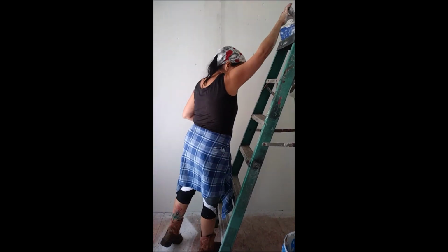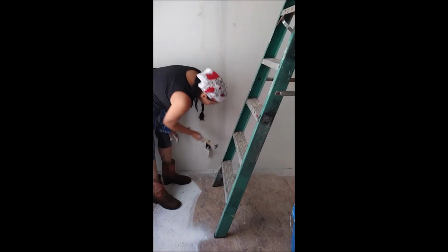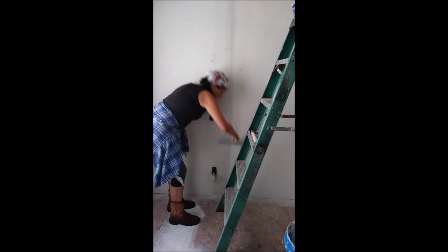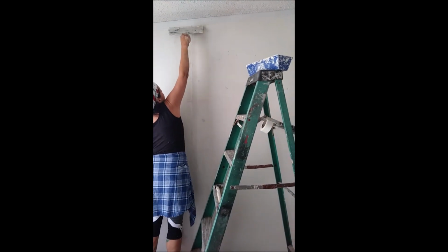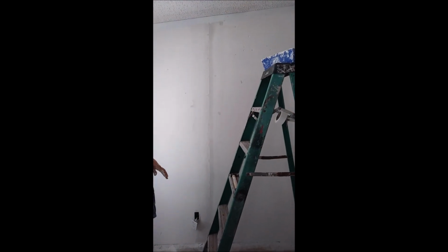And keep your hammer with you, because sometimes when you start bedding, you'll notice in that seam I had knocked down quite a bit. Sometimes when you start doing that, you'll see a nail popped, and you can go back and grab it. Okay, so that's going to be our first layer. I'm going to let this completely dry, and then I'll start my next layer.